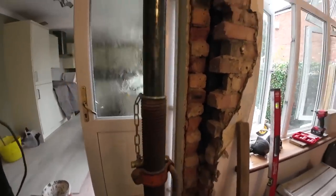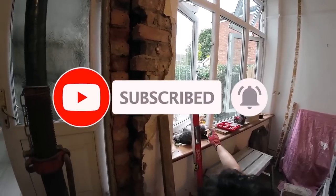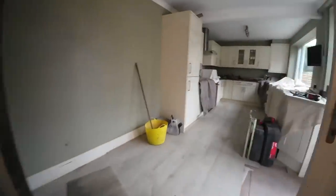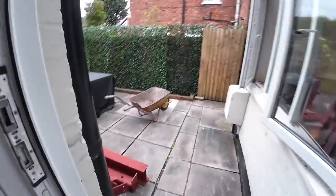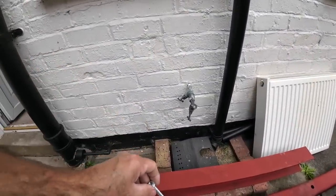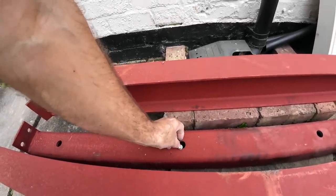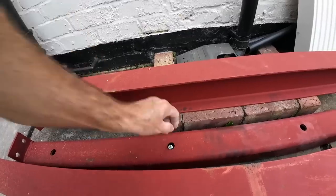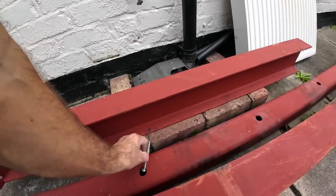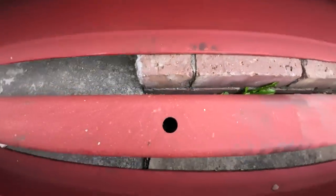We've got alternate fixings. I'm using these Thunderbolts that JM have sent. So you drill a 6mm hole and put these straight in with the ratchet, with the rattler. And I've drilled it in such a way that the hole goes through to the other skin. But the actual hole this side is bigger, so we can get through with our ratchet. So we just put an extension on the ratchet and we can. So basically, it'll look like that on the other side, come right through to the edge. See, it's a smaller hole. I'll show you when we get it back up there properly.